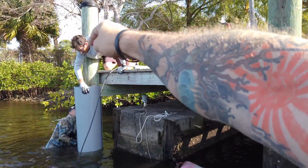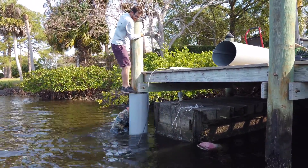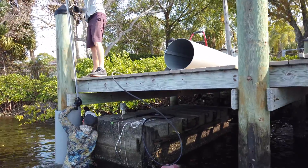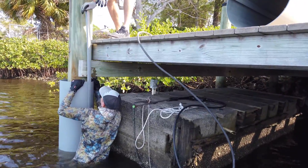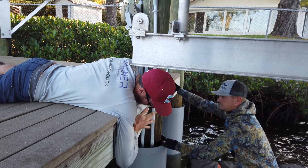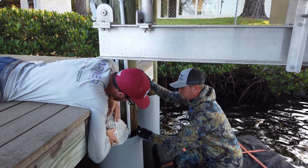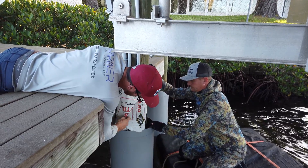Concrete will be pumped in from the top. They've got a little sleeve locking system that slides in there, and putting that in right now — then it'll be ready to be filled with concrete. Ready for concrete. These ones that have conduit in them, any kind of tubing or PVC pipes running down the side of the piling, they're pouring in fast-set concrete to make sure when they pour the rest of the concrete that it doesn't leak out of the bottom.